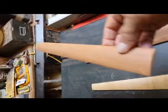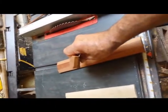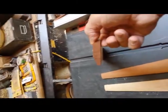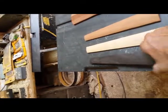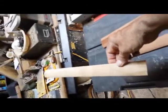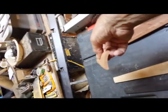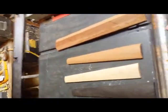After about two hours of work, the mahogany fiddle fingerboard is finished with a radius very close to that of the factory fingerboard. That was the piece of mahogany with 23-degree angles cut on each side. And what we have here is the factory ebony Chinese fingerboard, which is very nice, and for 10 bucks I'll probably continue using them. There's a shop-made maple fingerboard with the radius on it, and here's the one I just finished. It'll probably go on a cigar box fiddle that I'm in the process of working on. I hope you enjoyed my little journey through radiusing a fiddle fingerboard — thanks for watching.